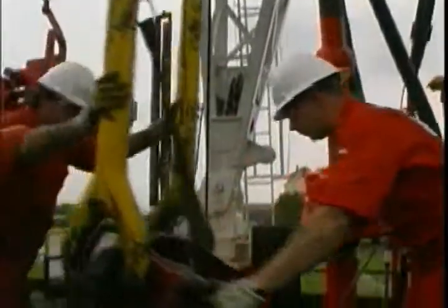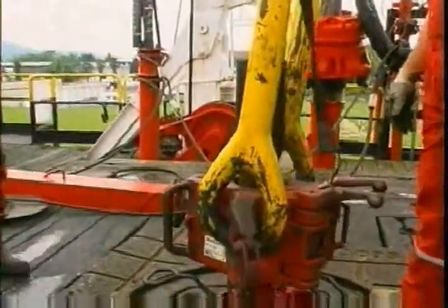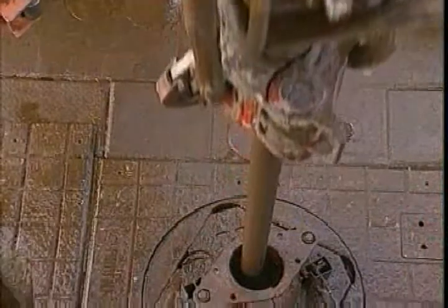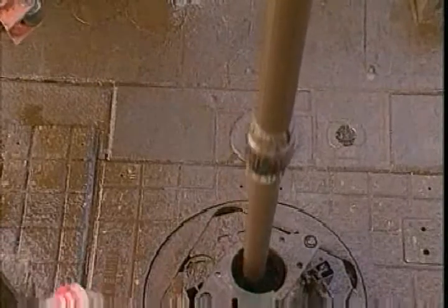As the elevators are lowered, push them away from the pipe. If they hit the tool joint box, its shoulder may be seriously damaged — this type of damage isn't repairable in the field. Don't pull the pipe out of the hole too fast; that will cause swabbing, which can easily create kick conditions or damage the hole so badly that it becomes a total loss.